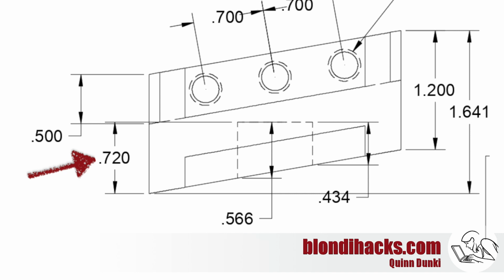So this 720 here is what I thought was going to be the depth of this hole before the angle was cut. However, the assumption that is not obvious in this diagram is that the diameter of the finished part is 2.5 inches. However, my stock is 3 inches wide. So what that means is that this space right here on a 2.5 inch diameter part is a lot smaller than on a 3 inch diameter part. And so by milling that 10-degree plane all the way down to the edges of the 3-inch part, what I did is I made this space here a whole lot smaller and effectively cut into the final dimension of my hole. But not to worry, we can fix this.